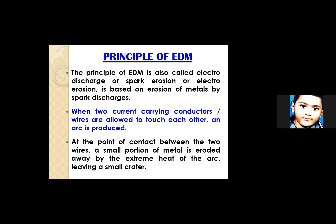Erosion of metal by spark discharge occurs between two poles. The workpiece is the conductive material — the anode — and the tool is the cathode. Once the spark occurs, metal is removed from the workpiece by creating a small crater. By controlling the crater shape, you get different shapes. The tool head acts as a template that creates the corresponding shape in the workpiece.